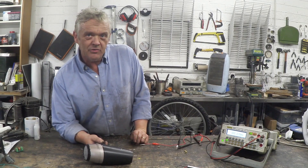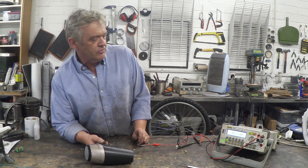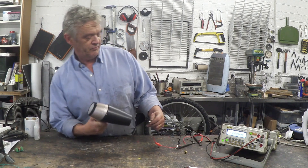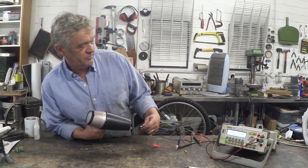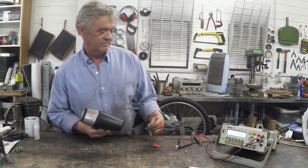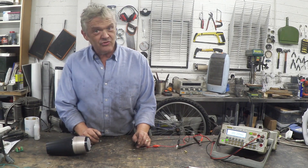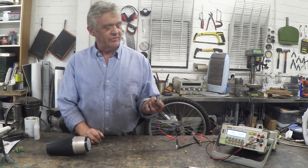Now if we stick a propeller on that and put some energy down there, it's going to spin quite quickly. But a propeller is very little more than a device for pushing air. If we blow air over the propeller, we'll cause it to spin and we should get some generation out of this. So let's set that up. It's on the meter in a no-load condition — it's DC because it's a commutated motor — and we got 1.2 volts from the hairdryer. It does about 10 milliamps actually, and that is cool.